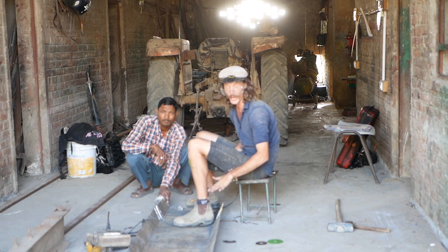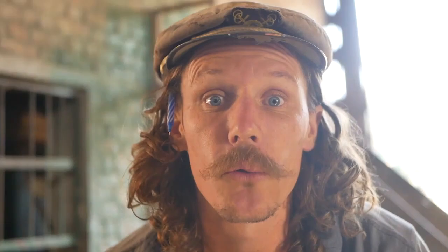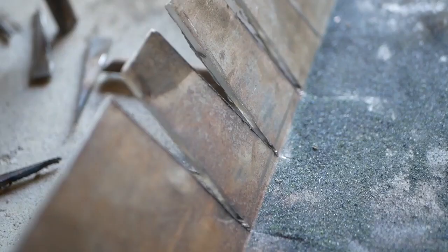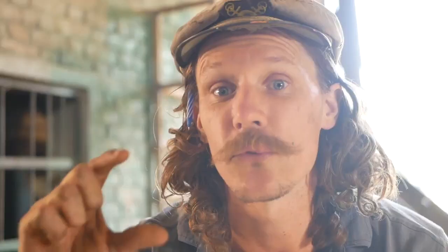We're cutting these notches into the metal here. You can do this either when it's flat or when you've bent it, and that will make it much easier to fold the whole thing up. Fold those in about 100mm at the edges, and then for the platform at the base of the slide you want it to go about 250mm from the end, then cut out small triangles only about 12mm wide at the edge, every 55mm. You'll then be able to bend the whole thing up and make that nice gradient curve.